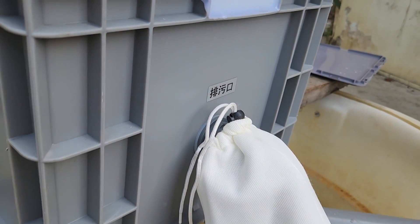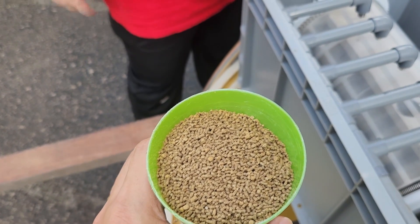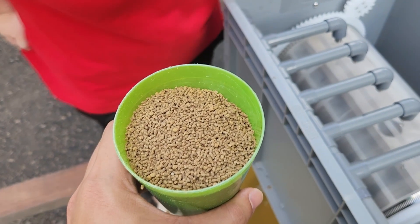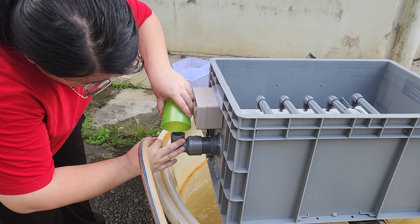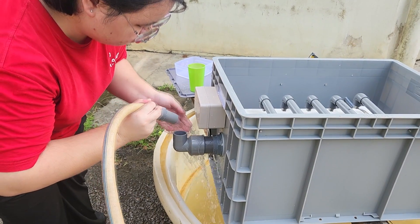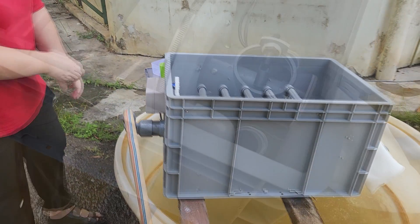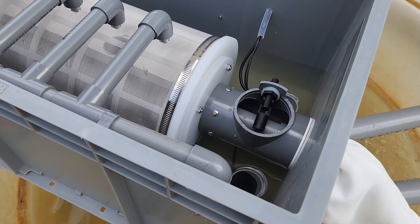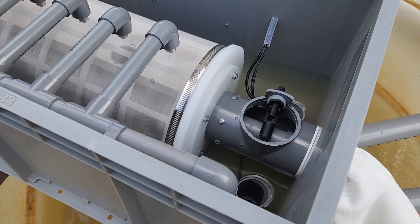This is the outlet where the waste goes. They actually provided some filter sheet that we'll use to filter out prawn waste. So now we're using shrimp feed and I'll be artificially introducing it into the inlet — not in any tank right now, just manually putting the feed inside and adding more water to flush it all into the screen. After putting in quite a lot of shrimp feed for multiple rounds, you'll notice the shrimp feed does not bypass — it stays inside the screen, which acts as a filtration system, and only clean water is able to pass through.